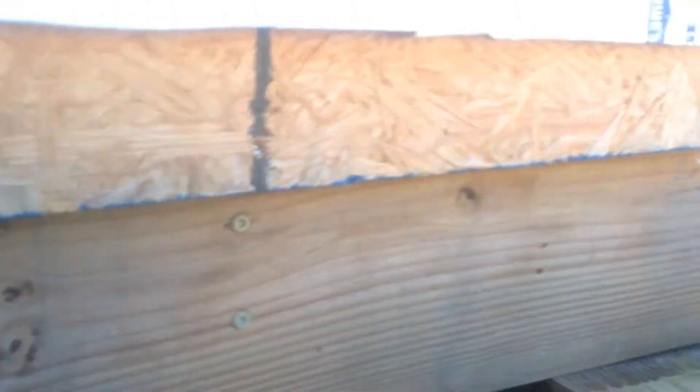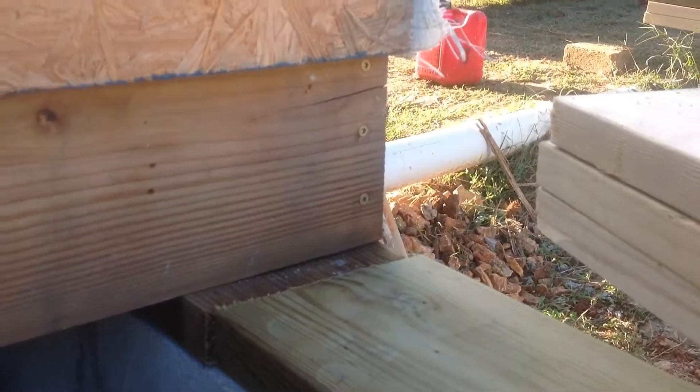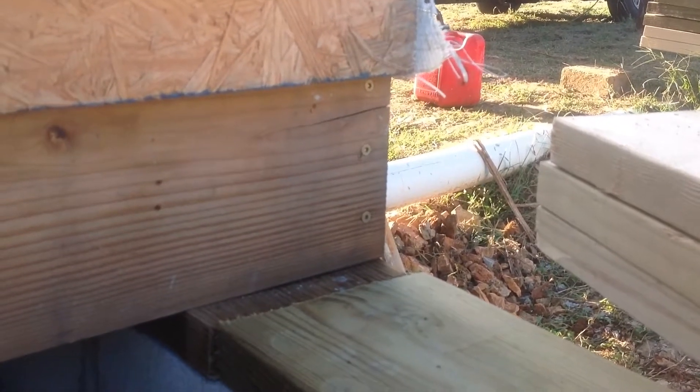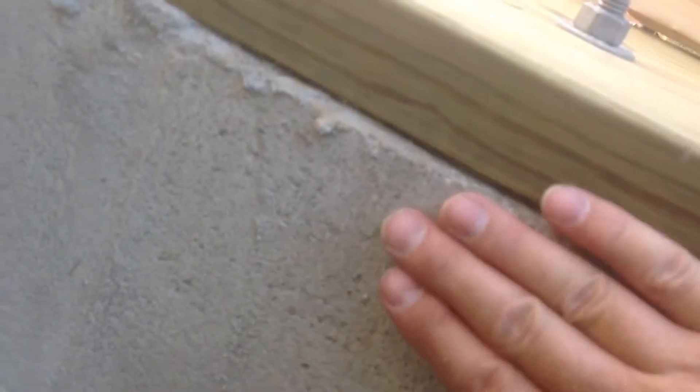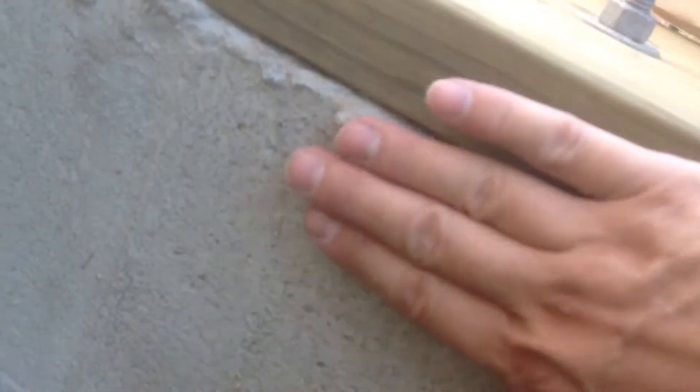On the outside, when we put siding on — and now that we've got a concrete block, we've got to actually repair that — because your sheathing will go down below a few inches, maybe an inch or half. I'll clarify exactly how much it is when I make the video, but your sheathing will go over your sill plate and onto the concrete so it overlaps and creates an air block. You put your siding down over that even more — just a little bit of a lip. That's what we'll do when we get to that point.